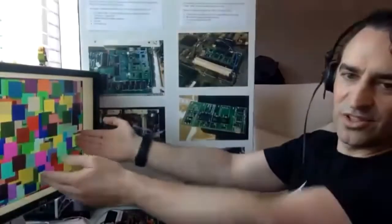Phil Pemberton was the first to realize that this debug system existed and implement fresh hardware to connect to it. I display the detailed soft test output, and I adapted this code, wrote some more, made a PCB, which lets you interface to the interactive side of the soft test protocol — that's accessing memory, exercising buses, through stuff like this on a machine which is otherwise horribly broken.